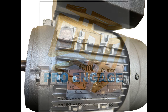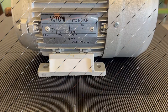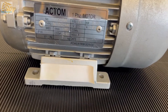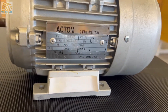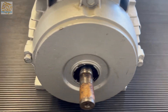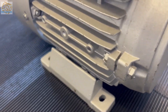In this video we do the electrical inspection or test for a single phase motor. This motor is identifiable through its nameplate and the design is pretty much the same as a three-phase motor — it's got everything that the three-phase motor has: shaft, bearings, front end plates, base, and in size it can be the same.